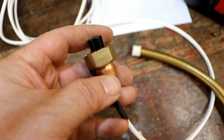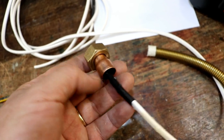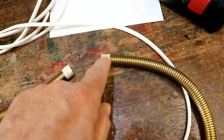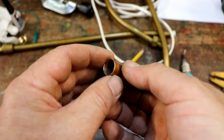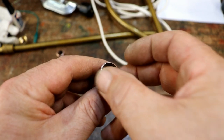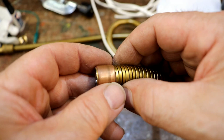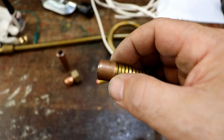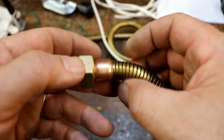This is why we glued these on yesterday. Having cut off the flange, these are tap connectors — end-feed to 15 mil tap connectors — because they happen to fit perfectly. Actually I need to cut a collar of 15 mil copper pipe, and then I'll cover myself in epoxy resin again. There's a piece of 15 mil copper tube deburred at one end with the little flange left from cutting. You can see it doesn't unravel if you twist it to close the spring up a bit — look at that, isn't that beautiful? I can glue that in, probably super glue, then push it into the tap fitting with the plug on it.